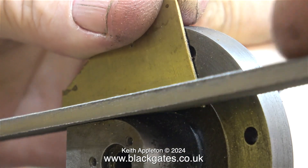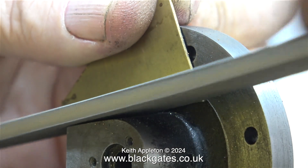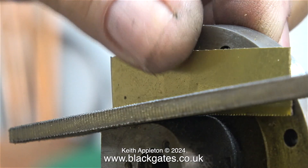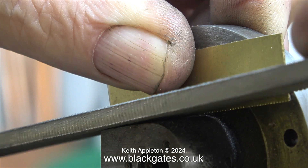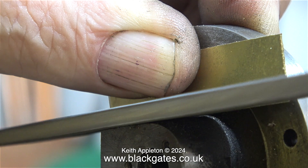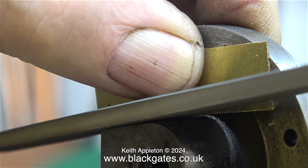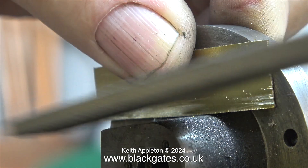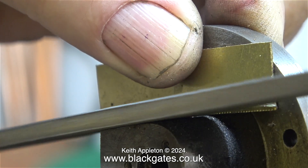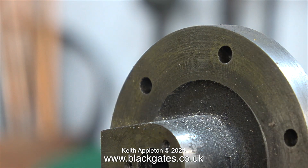I'm having to remove quite a lot of material to reshape this area, and it's like this because the original machinist didn't centre the casting properly before starting to turn it. But now I'm committed to making this part match the hole in the centre, as it certainly did not look right the way it was. To finish the job I'm using a thinner piece of brass, and now the part is the correct shape. As you can see there aren't any marks on the bolting flange, which is always a good thing.